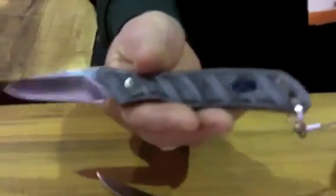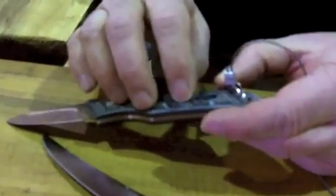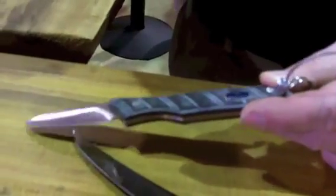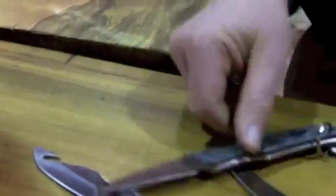What we did — it used to have a molded handle. After doing some research and looking at things, we found the Micarta handle actually provides better grip than the molded handle. Something a lot of people don't realize about Micarta is that it will absorb oils from your hand — it has a level of absorption for oils and liquids, but not to the point where it swells. It can actually provide better grip than something like G10 or carbon fiber. Micarta is something that 15 years ago a lot of custom makers used, then it kind of moved away, but now a lot of custom products are moving back to Micarta because it is versatile and basically inert. The oils from your hand actually change its color over time, which is why we machine it and leave it as is — we don't buff it.